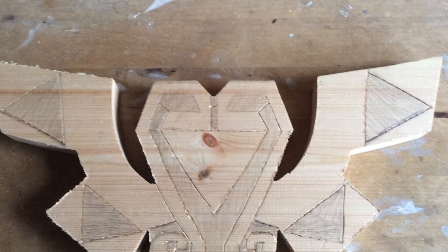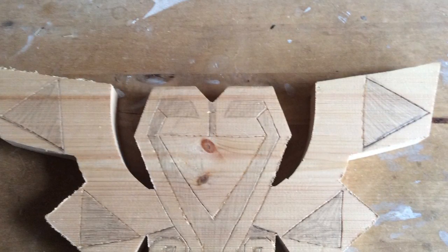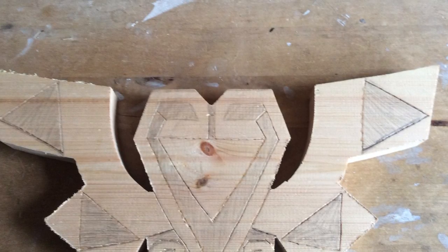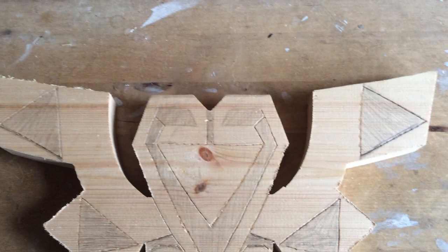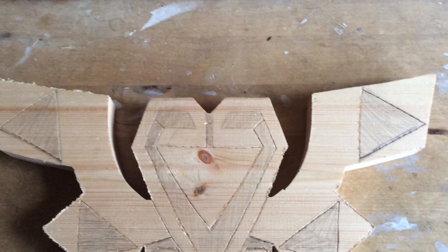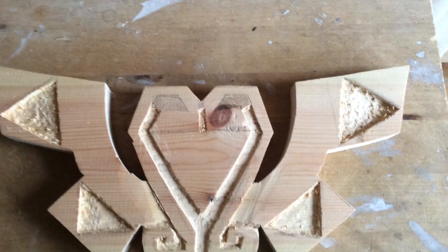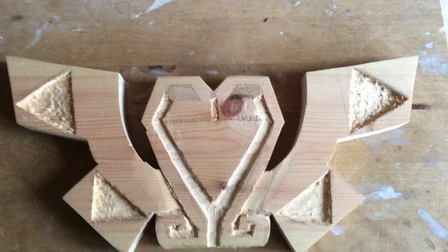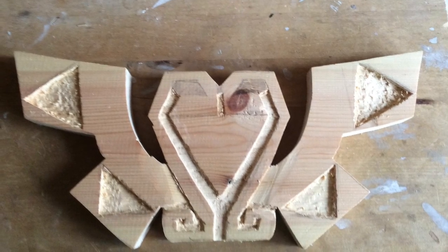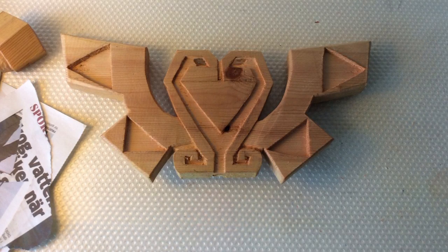Well, the blade had to sit inside of the middle part to a certain length, and that is why I did that. Then I actually just took the same chisel and started cutting out the holes and cutting down in it. But this obviously did not get very smooth, so I later used a special kind of plane to just smooth the surfaces down in the holes, or the cutouts, a bit.